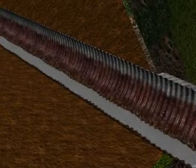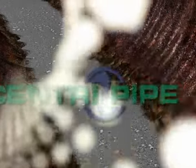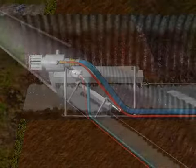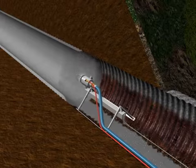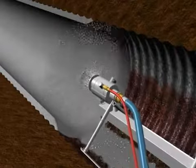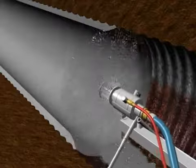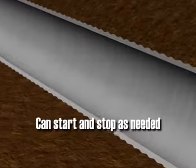PL12000 leaves a new pipe floor that may be flat or contoured to the radius to enhance flows. Then, CentriPipe's high-speed spin caster is placed in the center of the pipe at its far end. As APM's PL8000 concrete is centrifugally cast evenly around the interior of the pipe, the application head is retracted by a computer-controlled motor at the properly calculated speed to ensure an even thickness predetermined by the engineer.